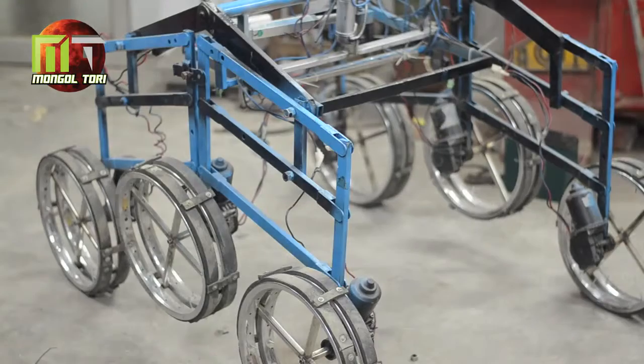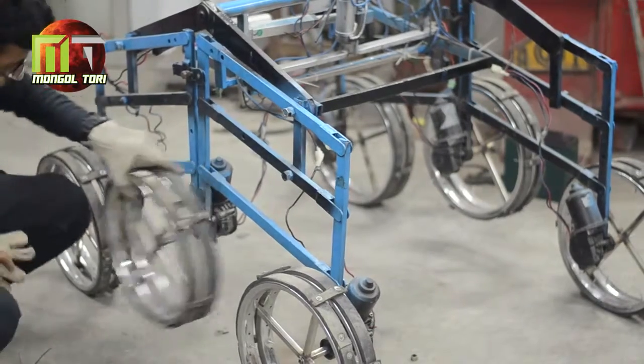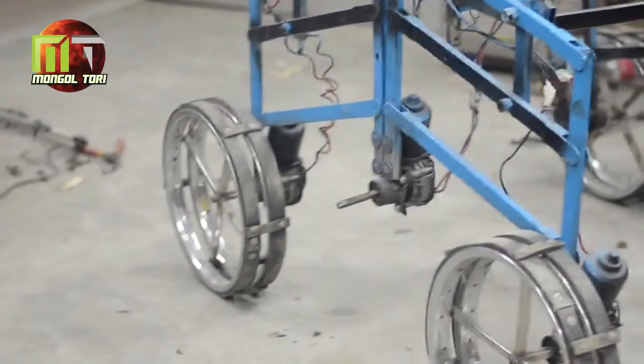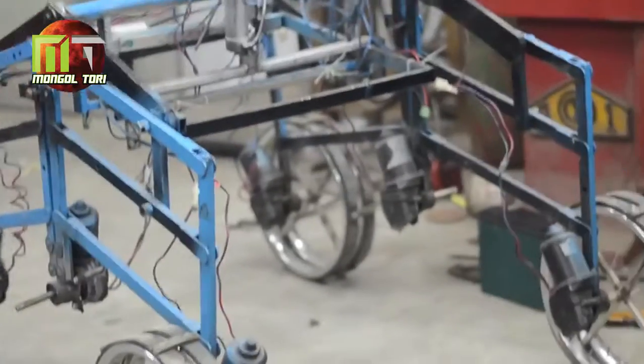To reduce weight while performing tasks with the arm, we will remove 2 wheels and 2 motors. Then we intercept the middle part of the bogies through a thick bolt and double nuts. Thus, the rover becomes 4-wheeled.